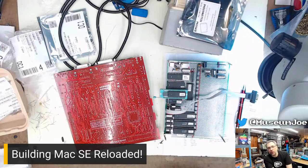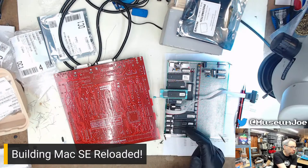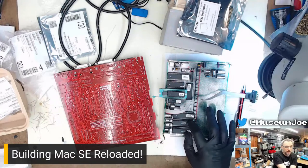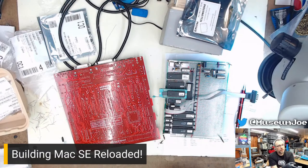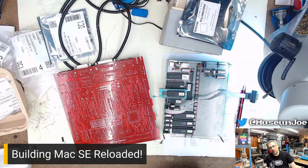These are digital potentiometers. You can see three of them. There's two potentiometers per chip, and each potentiometer is hooked up to one of the sound channels coming out of the AY3. Each one's coming in, and then the audio out of each potentiometer goes either to left or right. So by sending values to these potentiometers through the sound VIA, you can have independently panable stereo audio for each sound channel.